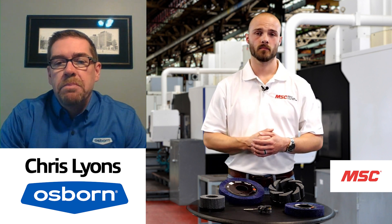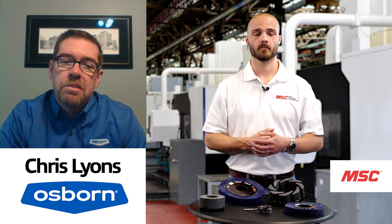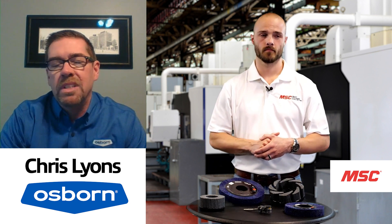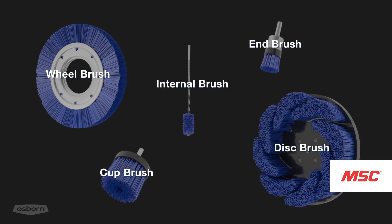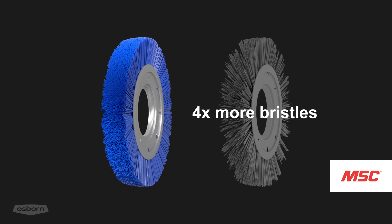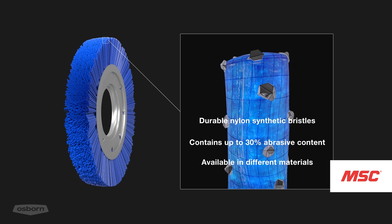Another reason is that people say they've tried a brush before — maybe ordered it online, got it in and ran it, and it just didn't work the way they expected. Typically that's because there are technicalities about brushing that, if they didn't know what they were doing, they wouldn't get that result. Also, surprisingly, a lot of people aren't aware that these brush solutions exist so they can incorporate them right into their machining center. Recently I was with a customer experiencing a lot of bottleneck in production because they're doing parts by hand, having to pull people from other departments just to do deburring. We've got a brush in there that we're testing now, and it's looking very good — it's going to save them a lot of time and money.